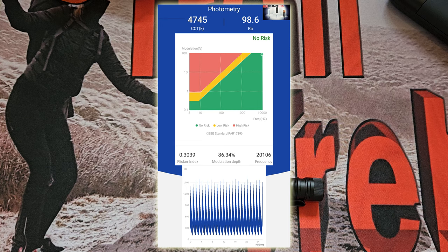So when I talk about CRI, I'm talking about colour rendering index. Natural light during the day, when you go outside, that's 100%. You get to see the full colour gamut. As you get cheaper LEDs, or LEDs that are more interested in output, it's not exclusive, you'll get a reduction in that. Somewhere around the 70 mark sometimes, or sometimes down to the 60, depending on the manufacturer and the setup. It's less pleasant to look at, and if you're a photographer, you certainly wouldn't want that. And outdoors looks worse, you're not picking out the nice reds, and greens can sometimes look a bit flat.